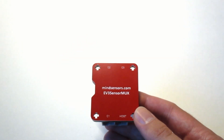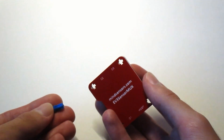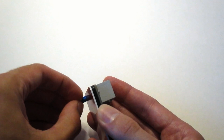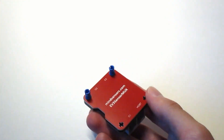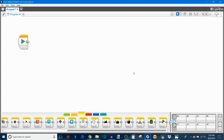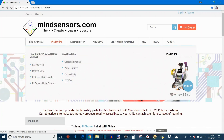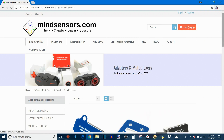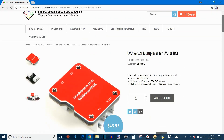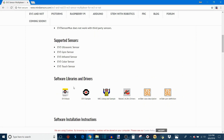These three channels correspond to the ports on the programming block, which I'll show in just a moment. You can attach this sensor multiplexer to the EV3 brick using cross axle to friction snap pins that insert right into the baseboard. You'll also need to import your Mindsensors multiplexer block into your EV3 programming software. To do that, go to Mindsensors.com, navigate to EV3 and NXT, click on adapters and multiplexers, and scroll down to the product page for the sensor multiplexer, where the EV3 block is available for download.